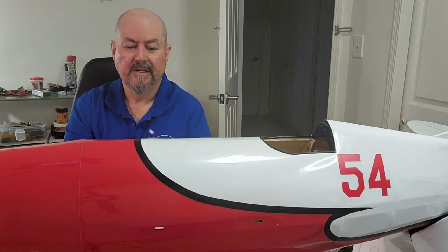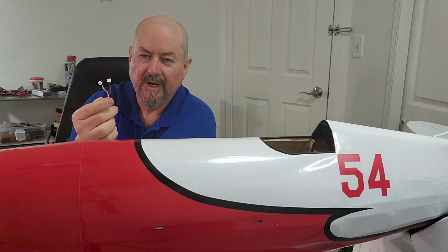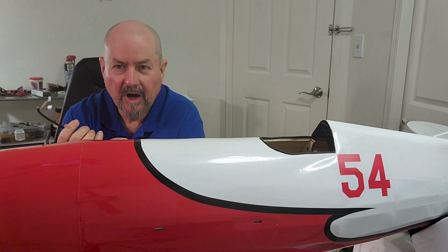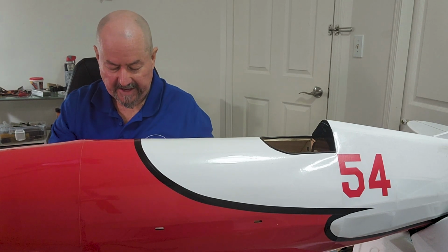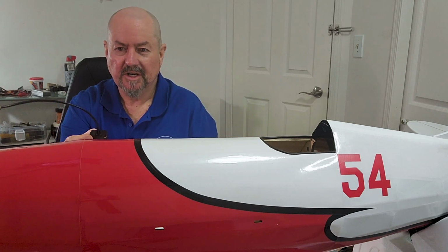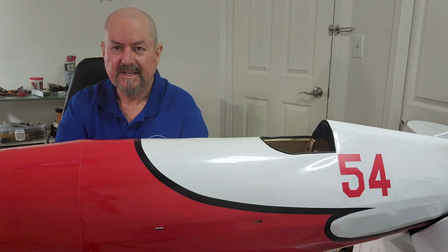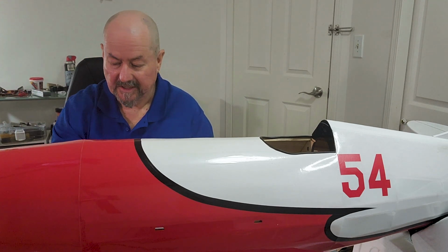But what it also has is this connector here, and I just absolutely love this. This is a CAN bus, or a DroneCAN connector. So this doesn't use your old-fashioned UART serial, RS232, RS422, whatever, modem sound, 57600 or 9600 baud connection to the flight controller. This uses a 1 megabit per second connection with a bus, DroneCAN, that can have multiple devices connected, and it's all software configurable, and you can get telemetry and debug through the wire to the flight controller, and even send that off to the ArduPilot developer team or to the Qio-Tek developer team to get support.